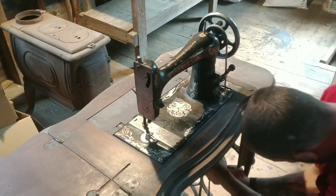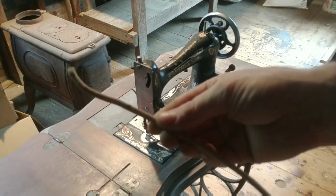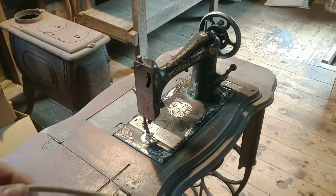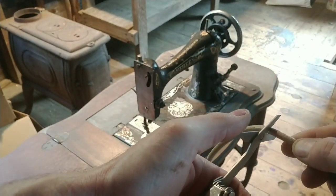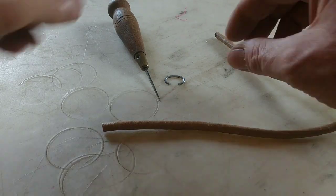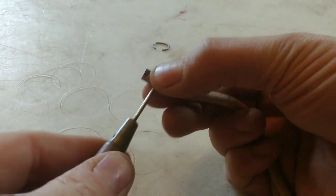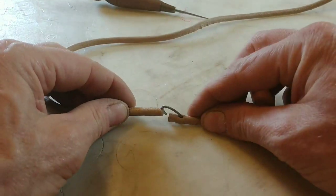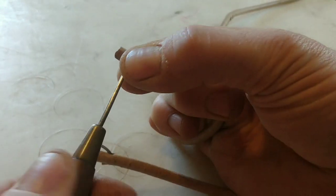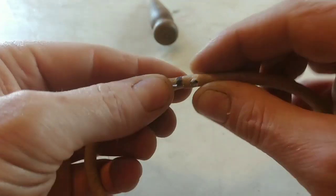Here I'm fiddling with the position of the bobbin winder. I'm never really sure which side those are meant to go on — I just look and see if the belt is interfering with the cabinet and go on whichever side the belt doesn't interfere. I've marked it and I'm just going to snip the ends off and take it into the leather shop. I've got the belt and the clip. I mark the positions and pierce them. You want to make sure your fingers are on either side of the awl so that if the leather rips, you're not jamming that thing right into your finger.